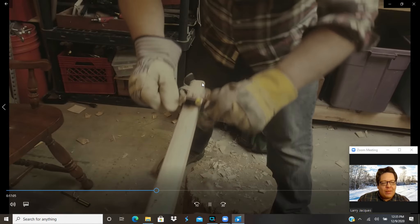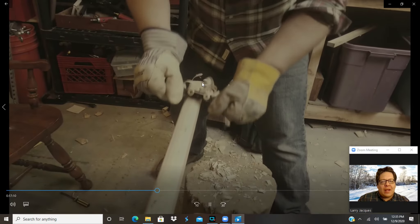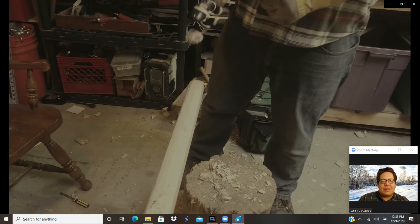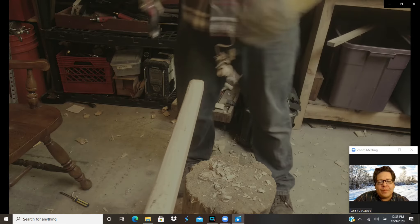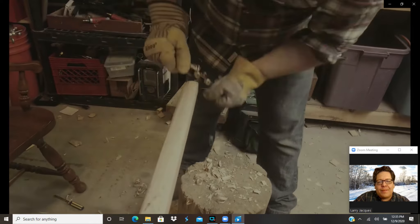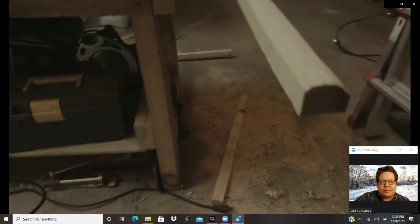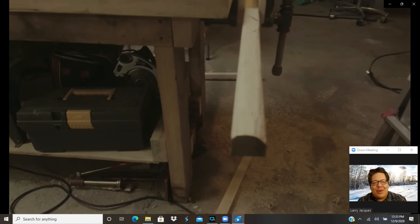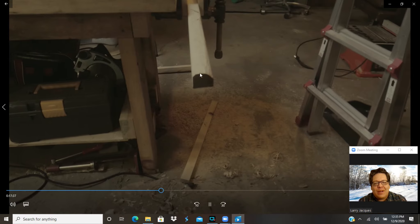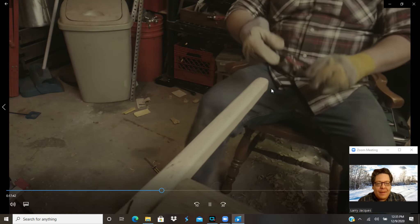When you're wood carving or doing anything, you just got to continually take a look and make adjustments and see how you're doing. Cleaning out some of the shavings and let's see how we did. A little lopsided — it's shaved down pretty good on one edge over here, but on this side it's real heavy. So kind of back to the drawing board — let's make some changes.